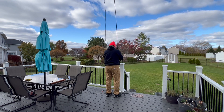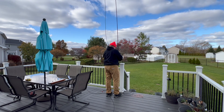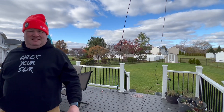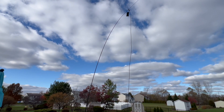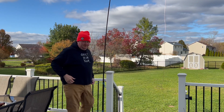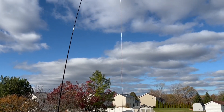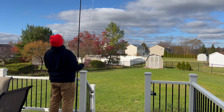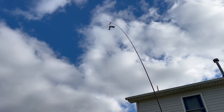I fed it up a few more sections to see how it's flexing. I know the coax isn't running straight up and down the mast, and that does impact how things bend and lean. Looking at it, that's only part of the way up and it's already bending quite a bit — I'm worried about too much strain. So I'm switching to RG316, the lightest of the coax I'm testing today. Not nearly as bad as the RG58, as you'd expect. That's certainly reasonable — very little bend, very nice — and I think it can work out just fine in the field.